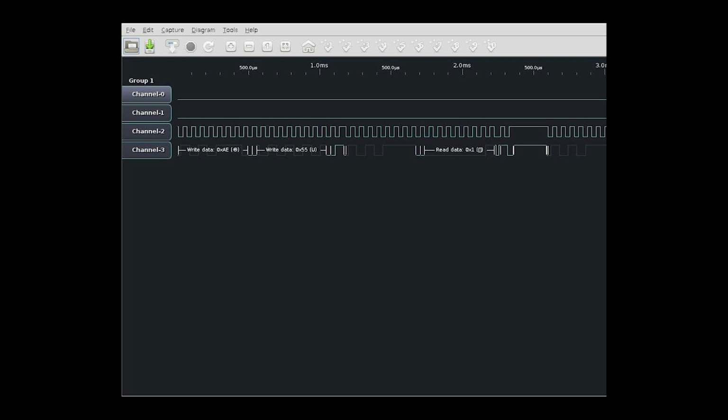I'll just switch back and forth so you can see the difference. It tells us basically that bytes are being read and written. It will tell us what the I2C slave addresses are that are being read and written from. We saw a lot of interesting strings in this capture right away. We saw the word ThinkPad as ASCII bytes. We saw the word T400, which is the model number of the laptop.